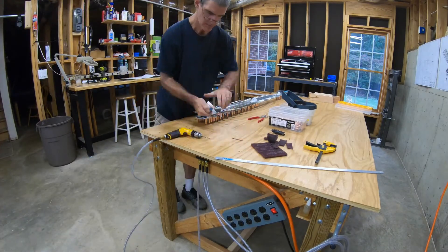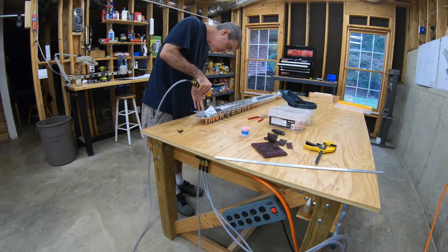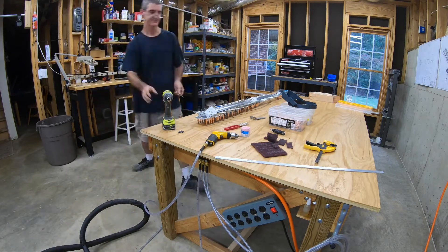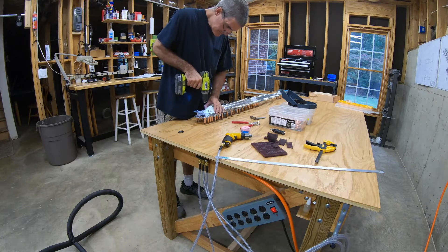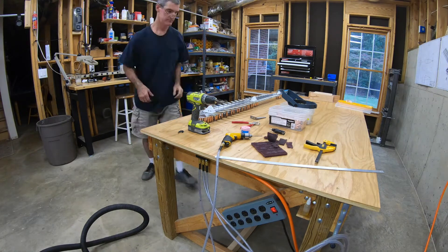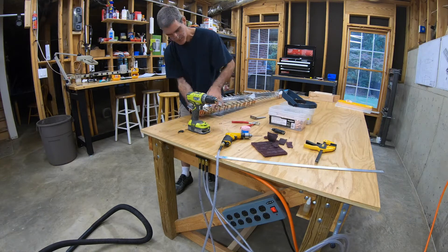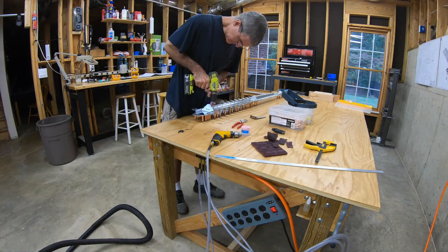Here I'm match drilling the holes through the lower rudder hinge bracket, through the spar and the doubler. These are holes for a number 8 screw, so you use a number 19 drill bit. This was a little frustrating — when I started out I was trying to use the pneumatic drill, which is good on speed and control but doesn't have a lot of torque. The drill bit bit into the steel of the bracket and just got hung up. So I ended up using the electric drill instead so I could go slow with a lot of torque, and that worked out fine.